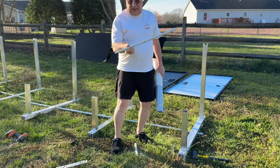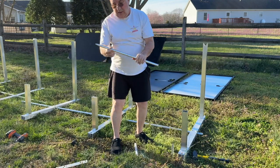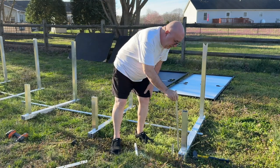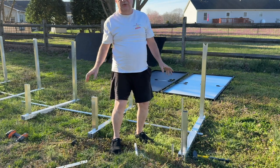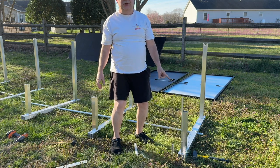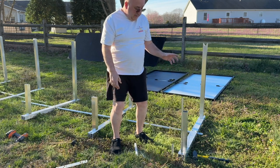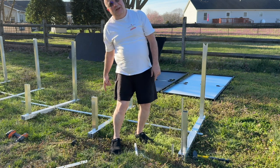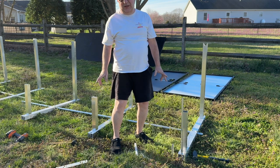When you get the anchor spikes, they come wrapped like this. These barbs are very sharp — they don't fit through the rack from the top. So don't put your rack in place until you put your spikes in. You have to basically do one at a time: line up the next one, drill it, put your tube in, put the spike in, and do that all the way down the line one at a time.